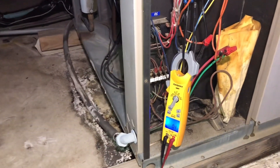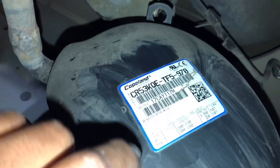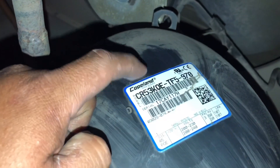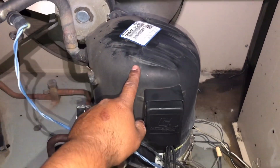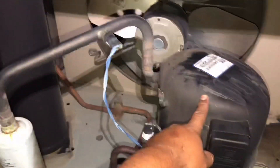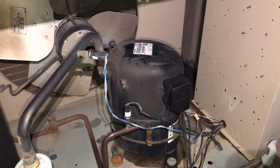We're getting confirmation on whether this is getting done tonight, but I wanted to show you this. You can see right here — that's a 2017 compressor, changed two years ago. But if you look up this model number and serial number on Copeland, it says this is a high-temp or air conditioning compressor for R22 — and this is a cooler running R404A. So when I pick up the compressor, I'll make sure to give them the model and serial number so they can confirm what's actually supposed to be in here. Get that Copeland app, guys — it really helps you out.